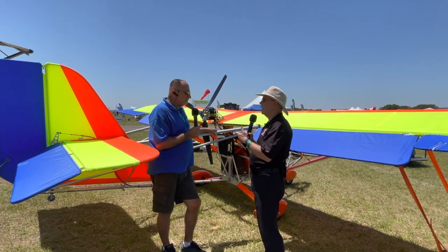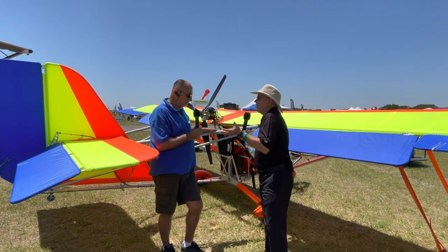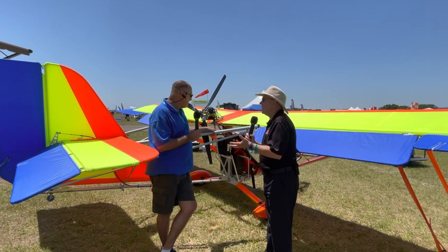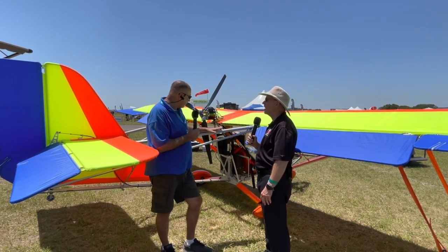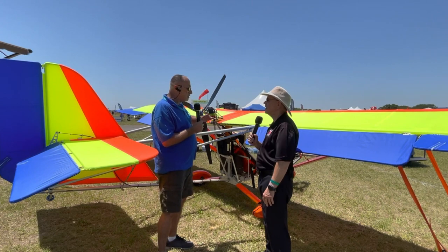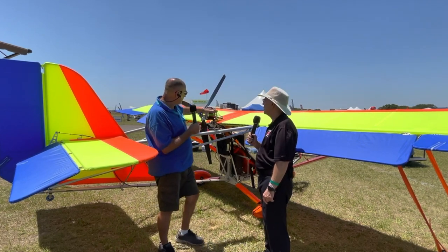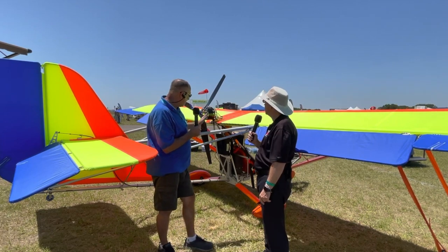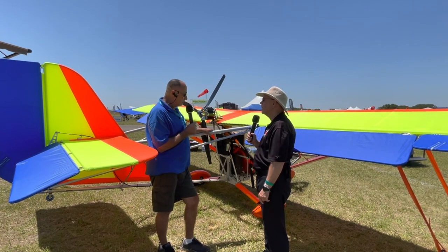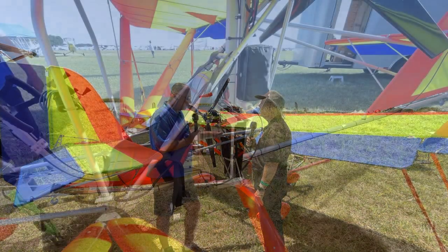You're collecting flight data and this engineer takes that and makes tweaks — it's basically programming changes to how the motor responds to various heat criteria. Heat's a major deal. We've got fairly clean airflow coming through the motor, and I've put this airplane into absolute full power climb and held it there at 40 miles an hour, and I can't get the motor to its max temperature. Motor temp, controller temps — we've got no issues at all so far.